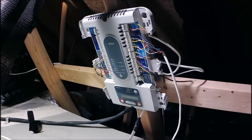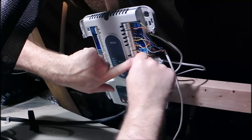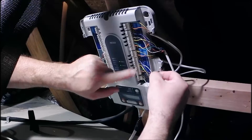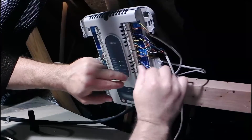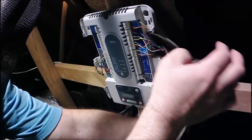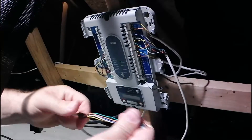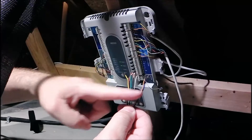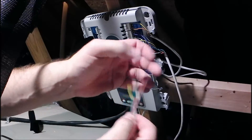All right, so here we are in the attic. The other end has the thermostat face removed from the sub base. Since this is a zone system, we're going to remove all these wires out of the zone board. Make sure you remember how these things are wired — at least double-check the color codes and the scheme the other technician used. We're going to take all the wires and make sure they are stripped to the same length, exposed with the sheathing removed.